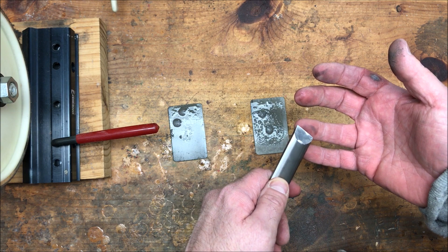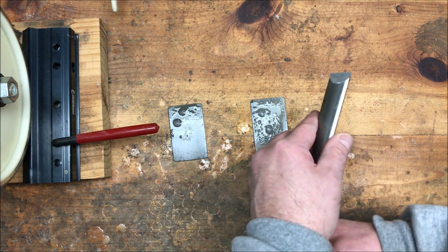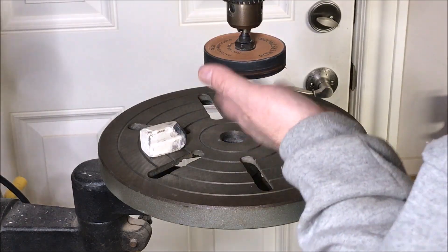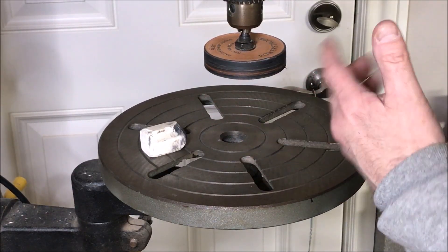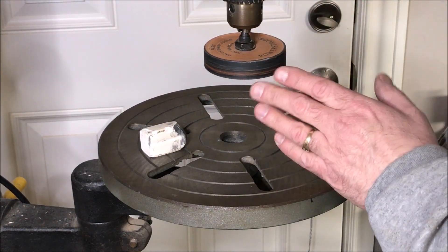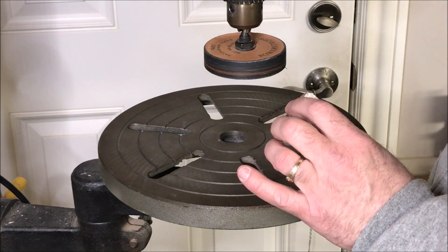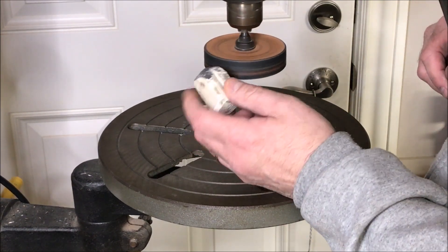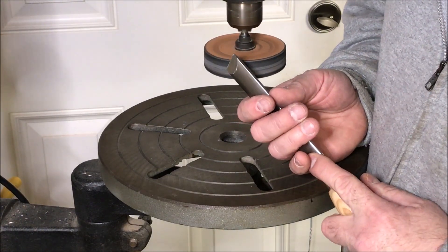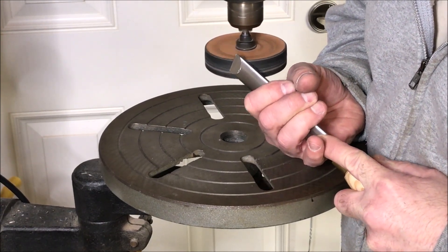I can feel the burr from top to bottom of the tool — it's much finer than it was on the first of the two card files. Now we're going to take this tool over to the strop. I use my strop in my drill press, and you can tell by how dirty it is that I've had this one for many years and stropped many tools on it. It's been a great addition to my toolbox and it gives a super polished edge on the tool. We're going to first put a little bit of compound on it — it comes with the strop — and now I'm just going to turn this tool so that I am sharpening with the bevel.